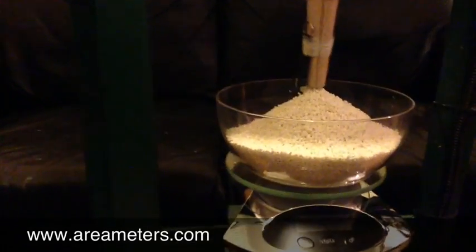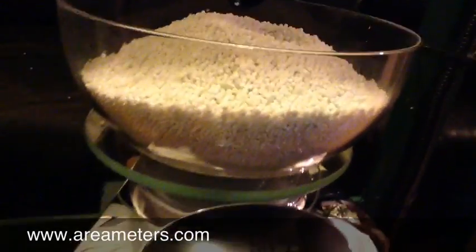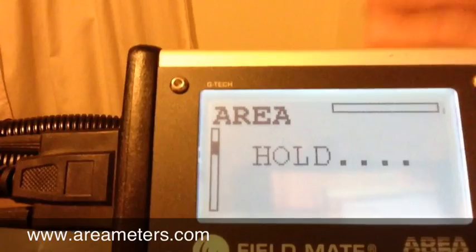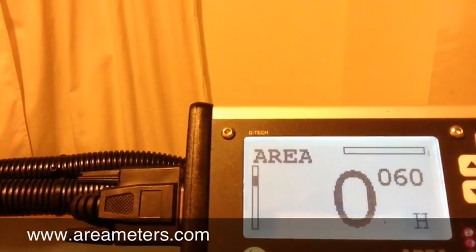We're just going to get a funnel to collect what's in there. We've got 609 grams. Make sure you can see that — 609 grams for drilling 0.060-something of a hectare. We could deduce we were doing 0.0609 hectares — we can back-calculate what's going on. She's pretty close — all in all a great system. We can go to a resolution of 0.1 kilograms per hectare.